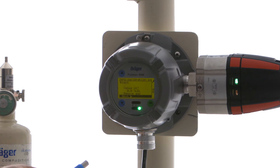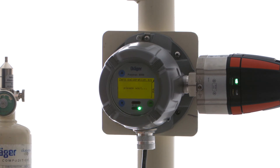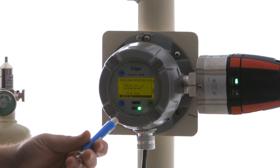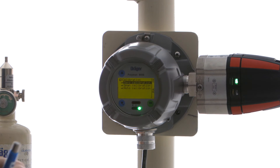It is zero — we're okay. It's telling us to remove gas. Because we're doing fresh air, there is no gas to remove. So we're going to say next. It's out of alarm range because we are reading 0% LEL. And we're done with zero calibration. So now we move on to do span calibration.